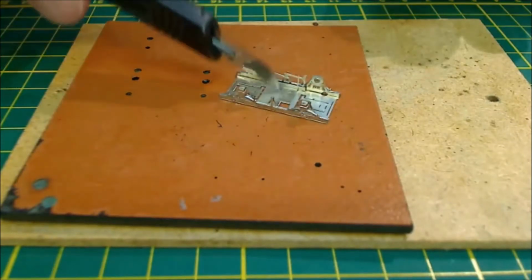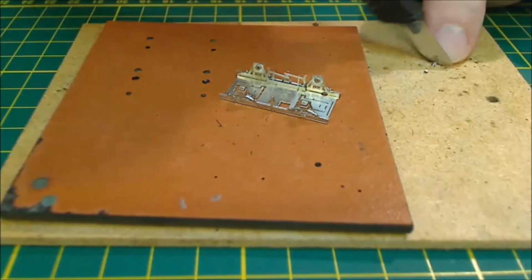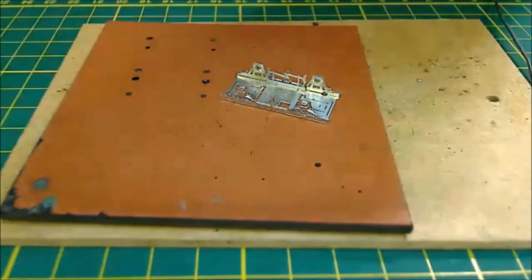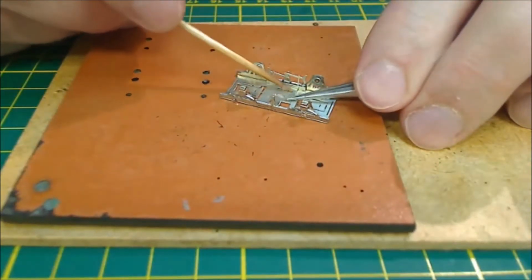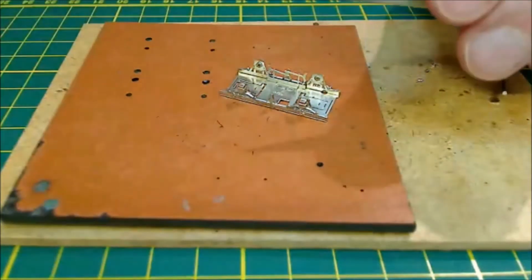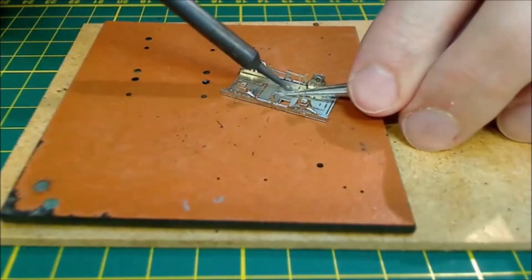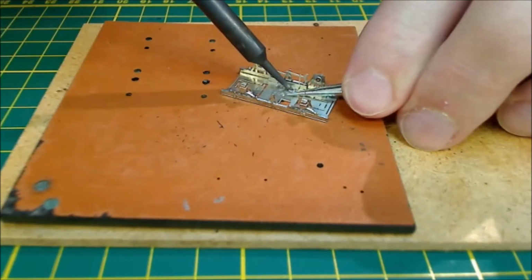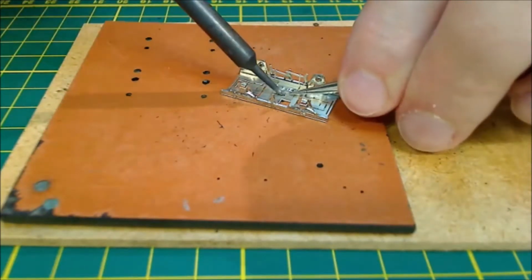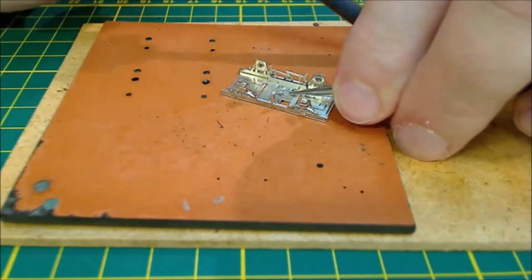And there's 3 little holes etched in which were designed to put the solder in. So I'll get 3 little slices of solder, get some flux on my cocktail stick, and just 3 little bits there. It's quite interesting doing this soldering backwards so that you can see and I can't. So I'll just hold the iron in there, and the flux will take the solder underneath this plate of metal. That's a bit of a chunky salami slice that I got there, that one. And number 3.